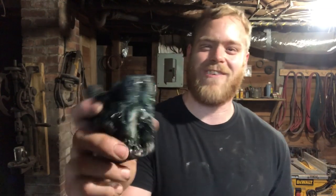After cracking open the crucible, here is what we got. It looks like we did get some melting going on down around here. I'm not even going to bother spark testing it to see if the carbon saturated like it was supposed to. I don't want to say this is an unmitigated failure, because we did learn some things — the borax was definitely responsible for the crucible rupturing last time, because this one was cooked for a total of four and a half hours and the crucible held up more or less fine. But it just seems like we weren't reaching the same temperatures as before, which is odd.